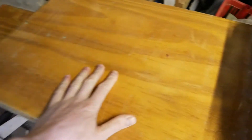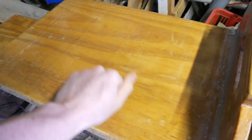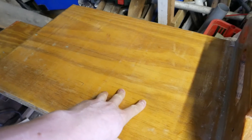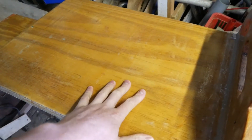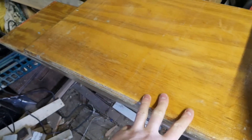As you can see, it's been glassed — the sides have been glassed, the top has been glassed — I just need to glass this other side. This is a fairly heavyweight fiberglass cloth, just one single layer with epoxy resin, so it's nice and strong and reasonably lightweight as well.